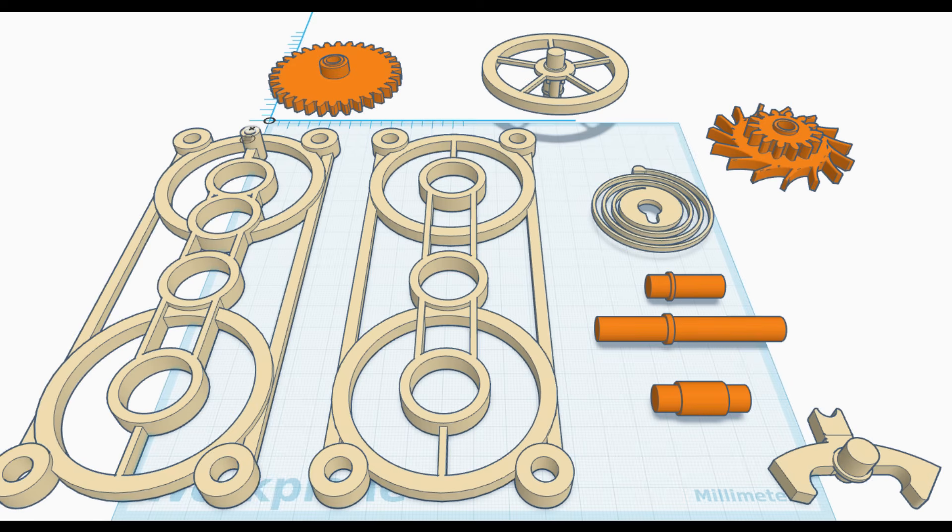Because it does something else — when we have a fork in there it catches and holds the mechanism for a brief period while it does that job, then lets it go and holds it again. So an escapement is quite a complicated thing trying to achieve all of those functions in one go. That's one of the reasons that if you do 3D printing and try to make escapements, you're going to be a bit disappointed because they take endless fettling to actually get them to work. So I thought I'd give it a go and try to make an escapement mechanism that would just work straight off the printer, and this is what I drew up.